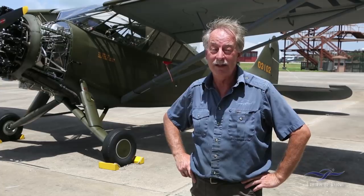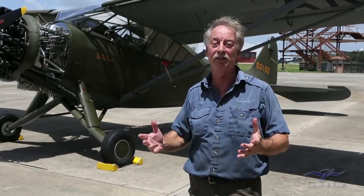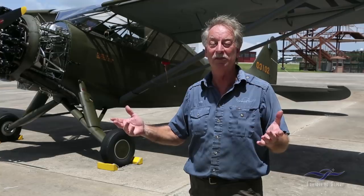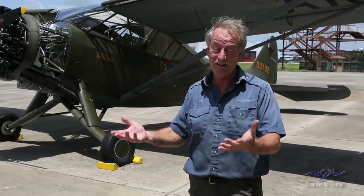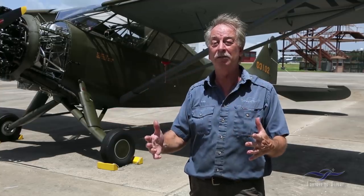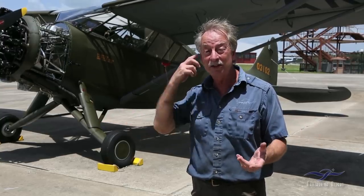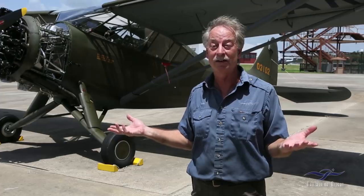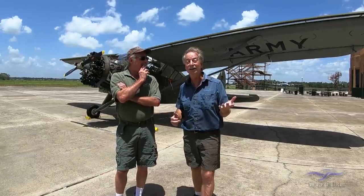At that point, I pulled the nose case off the engine with a view to checking the valve timing, which is a fair amount of work. Unfortunately, you really can't pull the case off and check the timing, because as you pull the case off, you lose the timing. The process then becomes to put it back as per the book, by the manufacturer's specifications, which is what we've done. At this point, it's a complete unknown. We've cured the magneto issue. We now know the valve timing is correct again, and if it moved, I don't know why or how. So we're still kind of in the dark until Kermit runs it up. Could be a great egg-on-face day today, because it may do absolutely nothing at all, in which case I shall start my weekend early and come back to it on Monday.